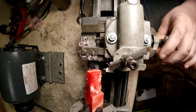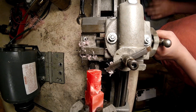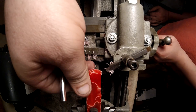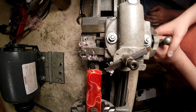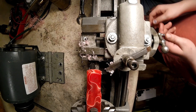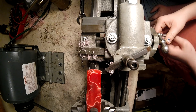Now turn the lathe off. Always keep your hand on the compound slide handle and reach around the end of the lathe — don't ever reach over top of the lathe like this, reach around the end with nothing spinning. All right, that's smooth as silk. It's almost round — that blank was not square, it was rectangle, and it was warped real bad. You have faced off that little stump off the end. Yay!